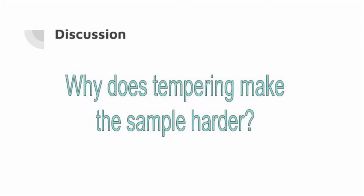Currently, we got two possible situations besides labeling the wrong result with the wrong group. One is tempered martensite embrittlement. Tempered embrittlement refers to a decrease in notch toughness of alloy steels when heated in or cooled slowly through a temperature range of 400 degrees to 600 degrees. Tempered embrittlement can also occur as a result of isothermal exposure to this temperature range.